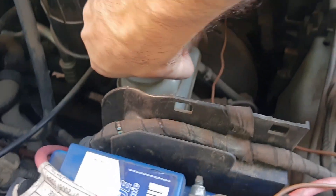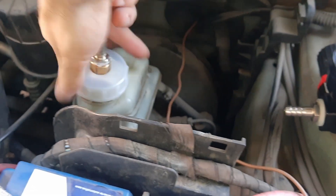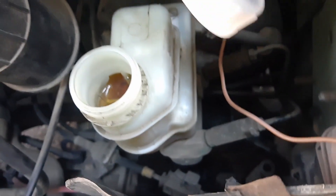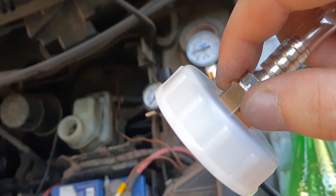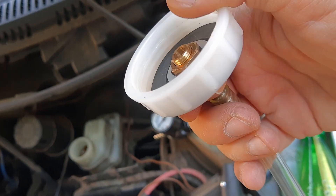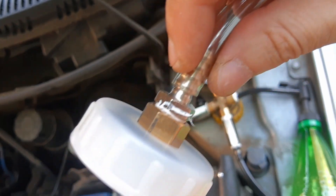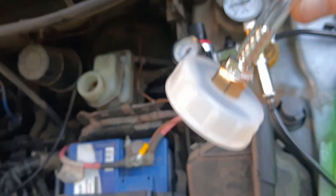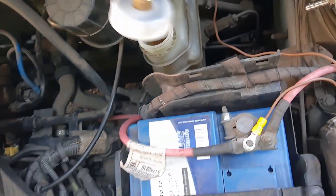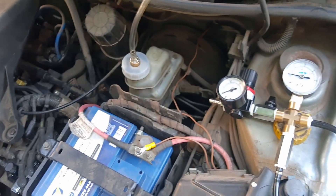Release the pressure — it was around one bar and now it went to zero. We still have around one bar here, then you just unscrew this. You can see my fluid level is almost empty — needs to be topped up a bit because I just bled one brake. This is how it looks: a reduction from one-quarter to one-eighth, a piece of rubber, and a one-eighth nut. Plug the one-quarter in, and that's it — much cheaper. Just top up, screw this back, and you can do one or two wheels at a time. Hope it helps — like and subscribe if you want to see more.